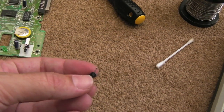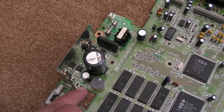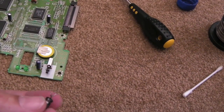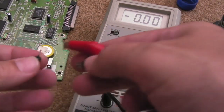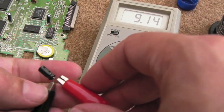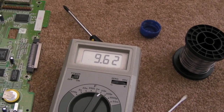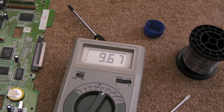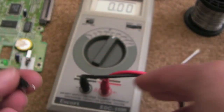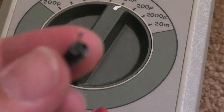I've had a good measure around on the board. I couldn't find anything but this one cap just near the power supply — 10 microfarad, actually part of the power supply circuit. It measures around 9.3 to 9.4, a bit under and going up, which is curious in its own right. Could be that it was reverse charged. I'll try and zoom in — I don't know how well I'll get focus on this.